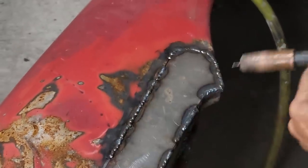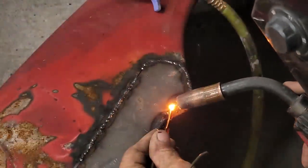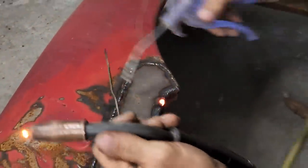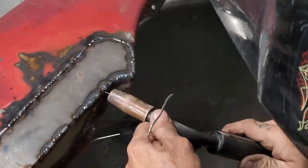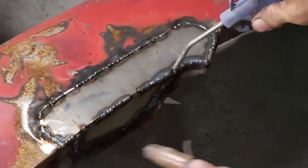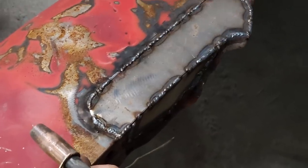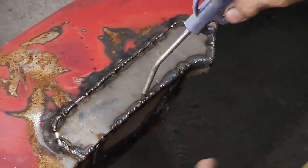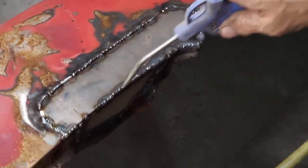On something like this, you'd want to undercoat it in between metal, even after you sandblast it. That's why it rotted out the first time, because it has two pieces of metal going together. It's obviously an envelope. I mean by an envelope, it catches the dirt. It goes in behind the piece that's in there in the second piece, but the inside extract goes in behind that and stays in there. Can't get out.